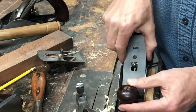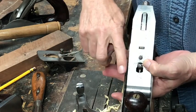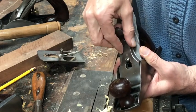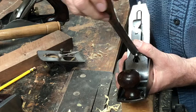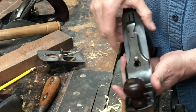I place the blade onto the frog and make sure it's seated well. If it's being pushed up, your frog is most likely too far forward or too far back and not allowing the blade to fit through the opening properly — so make sure it sits good and flat. You can loosen the lever cap screw when you first put the lever cap on, close it up — it'll be fairly loose — then come in with a screwdriver and just snug it up. Not a lot of pressure. Pull it open, feel it, make sure it comes down snugly.